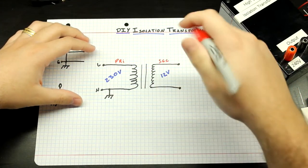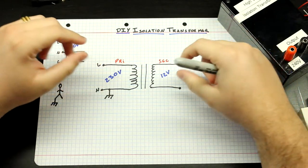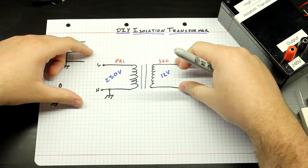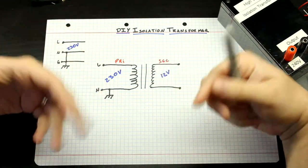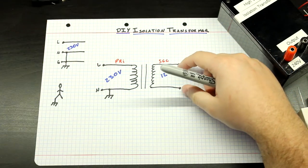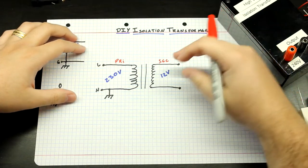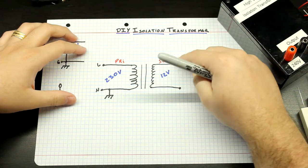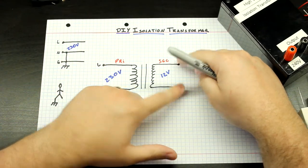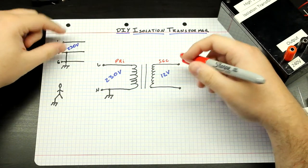In some cases, a small capacitor is deliberately placed between primary and secondary — as seen in double-insulated USB phone chargers — to give a path back to mains earth for noise. That's done for EMI purposes to pass FCC tests. So you have isolation because it's a capacitor with no direct connection, but it provides a reference path for induced noise on the secondary. Your 12V output is completely isolated; you can touch either wire safely — until you touch one and earth-reference that side of the circuit.